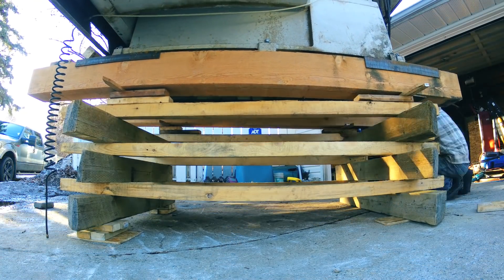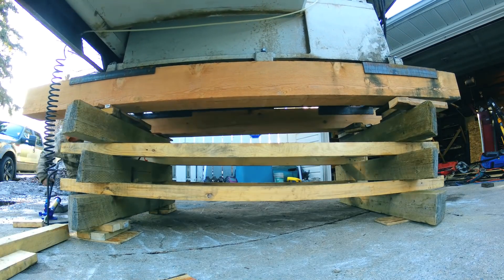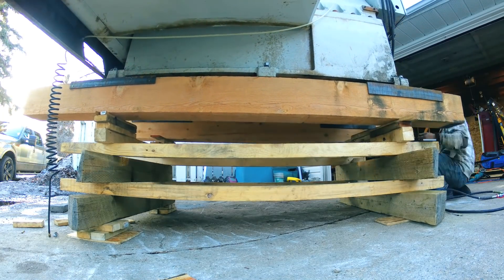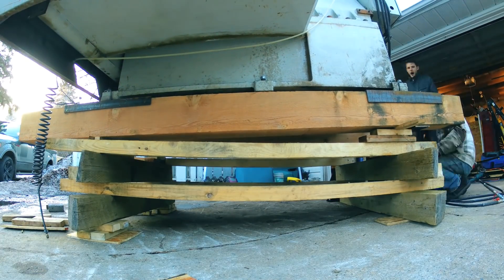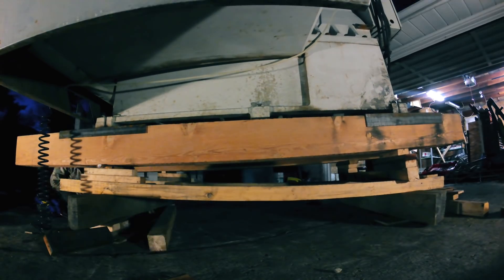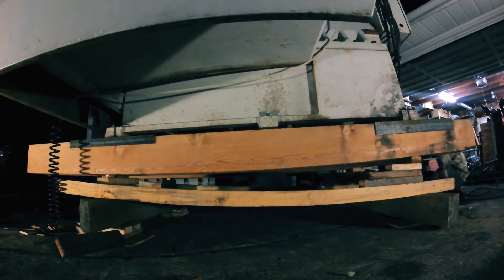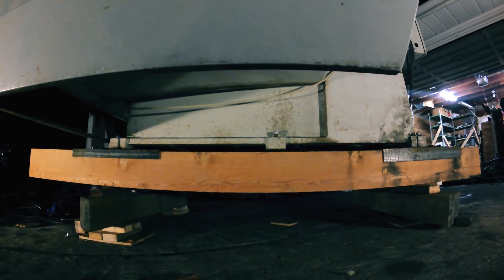How I'm going to do that is I take the jack to about 90% extension, lift it up that last 10%, which takes the weight off the blocking. I take out as much blocking as I can, then release the jack to about the 10% point. That last 10%, I shim it to take the weight off the jack, then extend back to 90% and repeat — back and forth until it's on the floor. Still a lot more to come. Like, comment and subscribe. Thanks for watching. I still need to get it inside the building, but that building needs to be lifted up another four feet. Stay tuned!